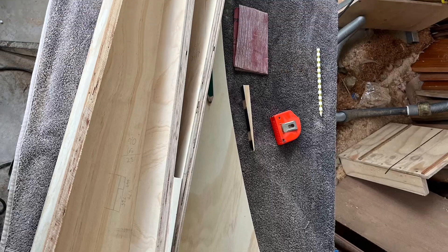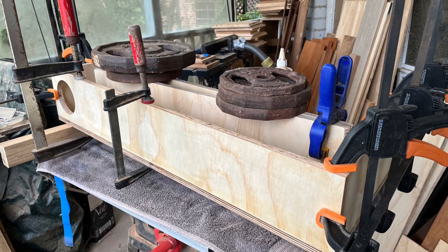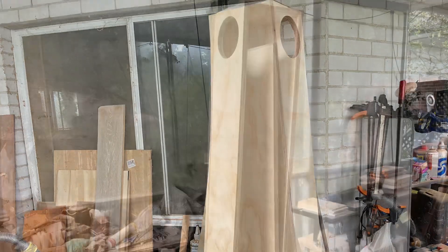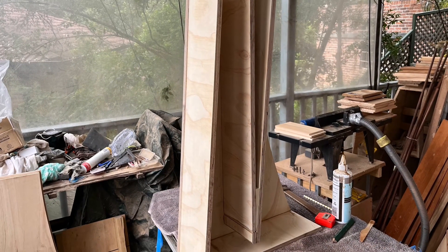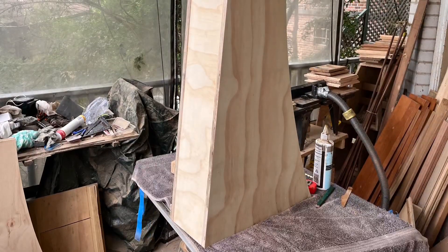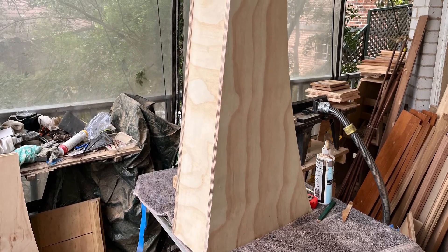There are the two front baffles. As you saw in the earlier photo, the front baffle is actually sheeted with a piece of hardwood over the top of the plywood front baffle, so the plywood is only structural for the integrity of the cabinet. Here's the final shot on my workbench with the final side not yet fully attached, just for the photo.